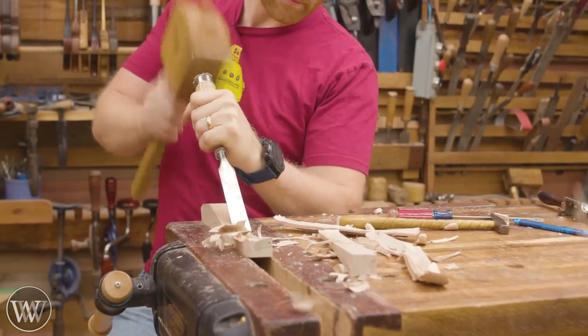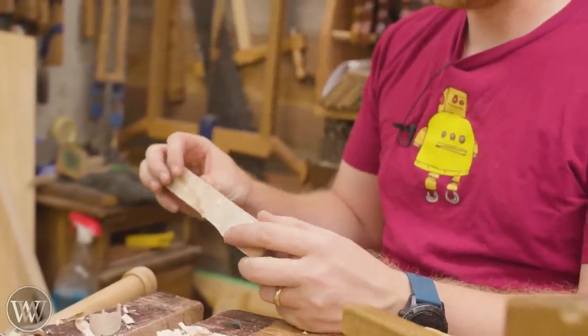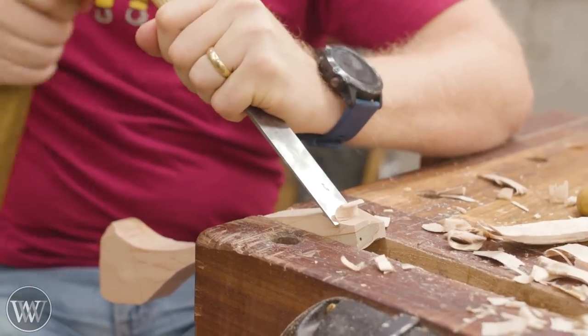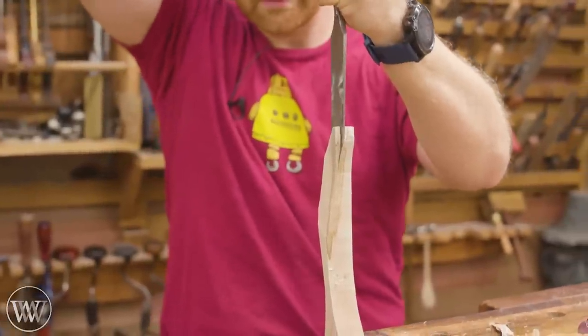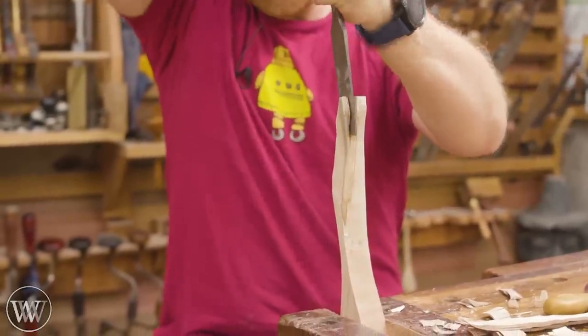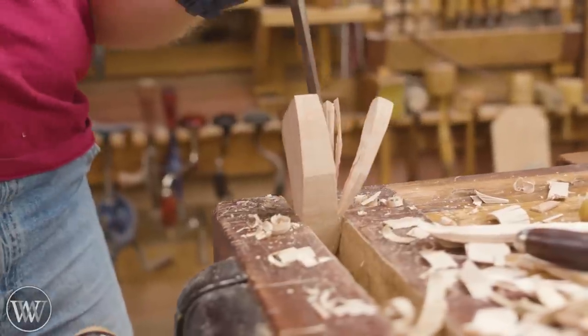As you can see here I'm going past the line — the line's really just kind of a guideline. As we all know there are more guidelines than rules anyway. As I go I'm just checking it, feeling it, seeing if this is the shape I want, whether I want to take off more here, just bringing it down into its rough two-dimensional cutout shape. The hardest parts are cutting across the end grain. I can end with that tailpiece and then I want to thin out both the handle section and the top, so it's easier to clamp it in the vise and chop down and let the grain flow. The handle has a curvature in and out, running with the grain, which makes it easier to work with the spokeshave — you're going right alongside the grain rather than always against it.